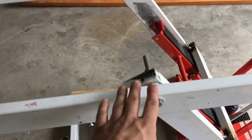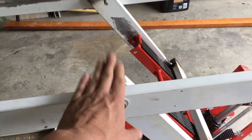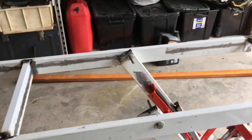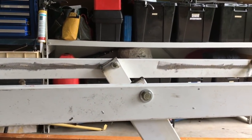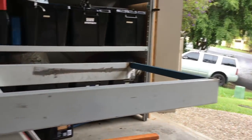Another thing I did: as you can see, these sit out a little bit high, a little bit proud of the top. So I'm just going to trim those while it's in its highest position, then cap them and weld them — that way they won't interfere with the lid when I put the top on it.